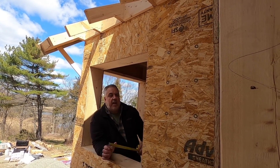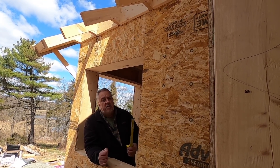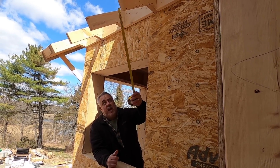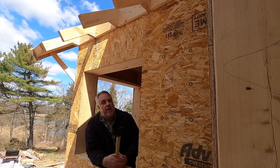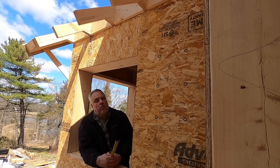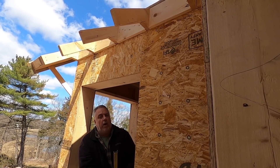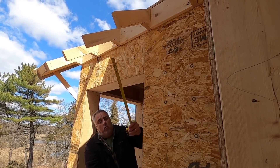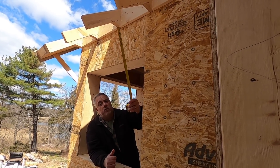You really have to understand in the design phase what look you're going for and whether you're putting gutters on the house — it's always a big question to ask up front. Because if you designed this with a really cool square cut fascia and some nice soffit detail, and then the homeowner asks for gutters, you're at a bit of a loss. They do make gutter systems that hang from the rafters, but it's a far better solution to use the plumb cut when setting up for gutters. Obviously on this project, we're not using gutters, so we went with the square cut.